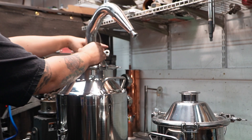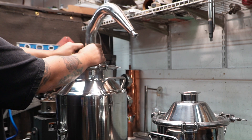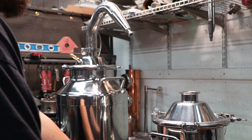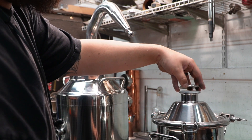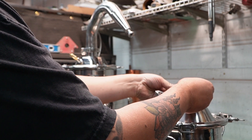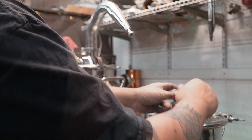Building the thumper completely level with your cans can be a challenge. Noah highly recommends installing the traditional head onto your main boiler, then lining up your thumper stem pieces flush with that head. Clamp everything down and ensure everything stays consistently level. Once you're there, tack everything in place and complete that weld on both sides.